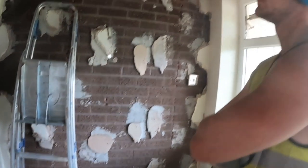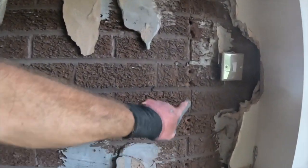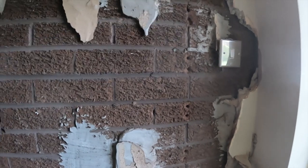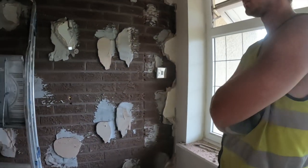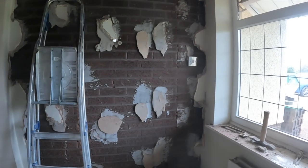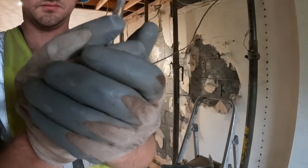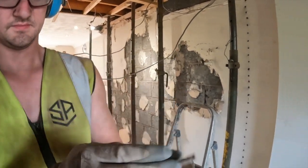Right, just after break. Are you done? Nearly done with the stitch drilling? Yeah. Luckily, there's less to do here because we're right on a perp. So Alex has done all that. Drill bits, how many? Three? Three have gone. Yeah, these bricks are like engineering bricks, rock hard. One of them was brand new the other day. They just melt because of the heat and they disintegrate.